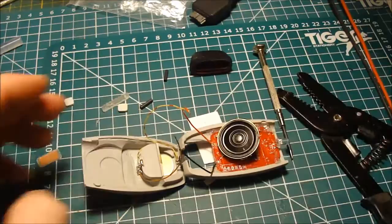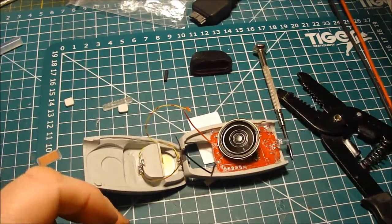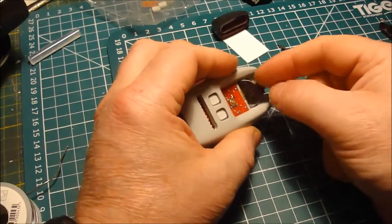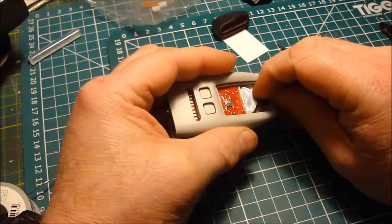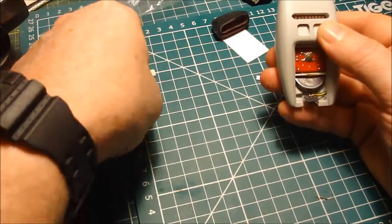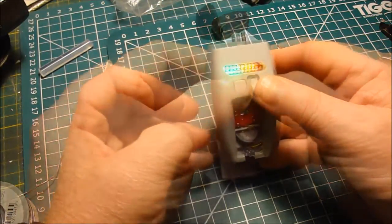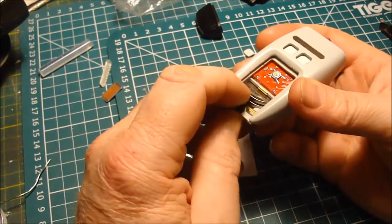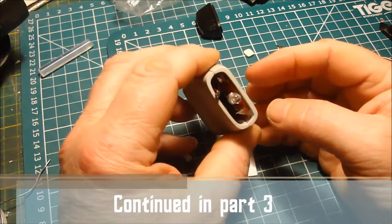So they will need soldering, and then the supplied heat shrink can be popped over them, which is superb. So they are soldered together. I'll put the first cell in and then the second cell, switching it on — so it should now have power. I haven't glued anything together yet, I am just trying it out. There we go. I'm happy with that, and I'll turn it off. At this stage we shall glue it together.